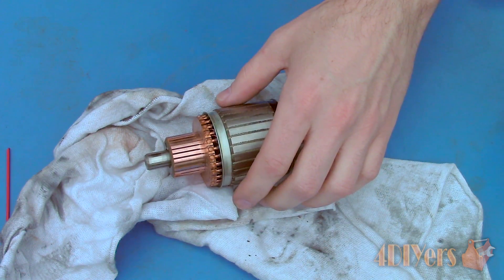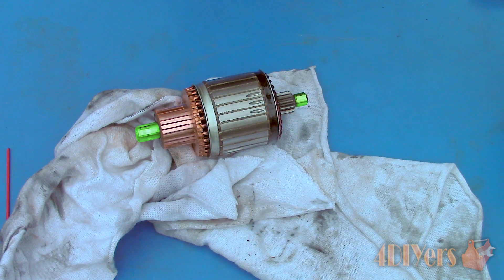The basic parts of an armature: here is the shaft which allows the assembly to rotate in the bearing or bushing. Next is the commutator, made up of various bars where the brushes ride, creating a connection to allow electricity to flow through. Each of those commutator bars are connected to the armature windings. The windings are unfortunately hard to see as they are mostly hidden by the lamination stack. The lamination stack is broken into segments, and one of those segments is called the tooth.